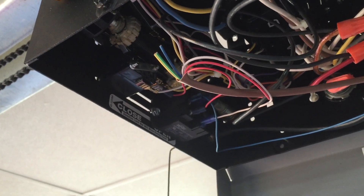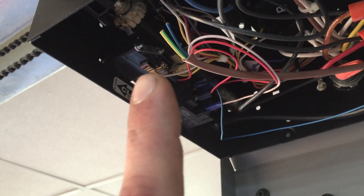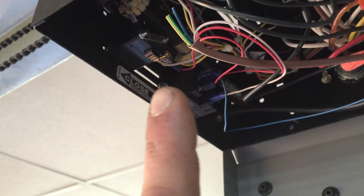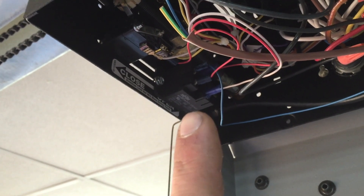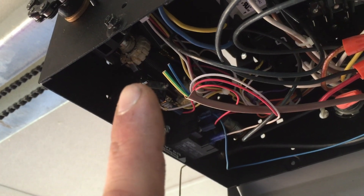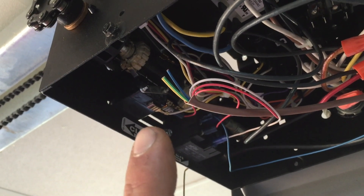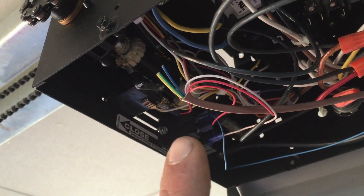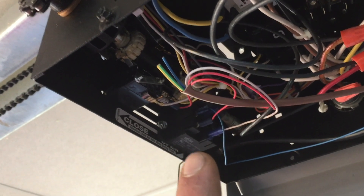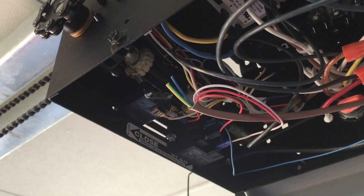I had over-complicated it a little bit ago. With a normally open contact on the red wire that's tied to this relay or limit switch, it will energize the coil on this DC voltage relay and close those contacts whenever the door stopper hits that position. As soon as the door moves, it will de-energize that terminal, which will open that circuit and shut off the heat. So it's pretty straightforward with the DC relay and the limit switch that is in place.